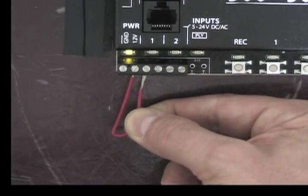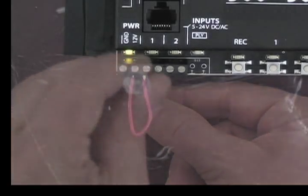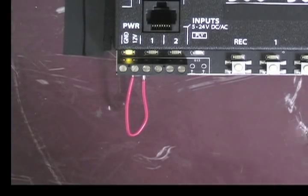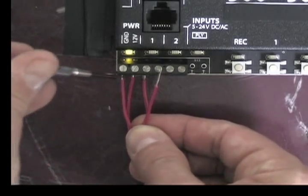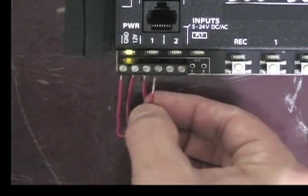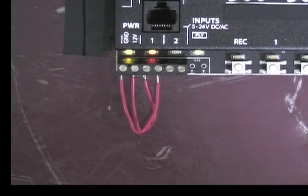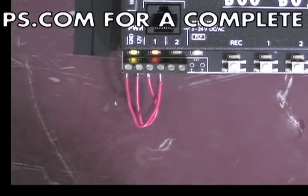In this case, I'm going to put the jumper over to trigger 1. The simplest way to trigger the BooBox 4 at this point is to place a jumper into ground and terminal 2 of input 1. This will cause the scene to continually play and loop.